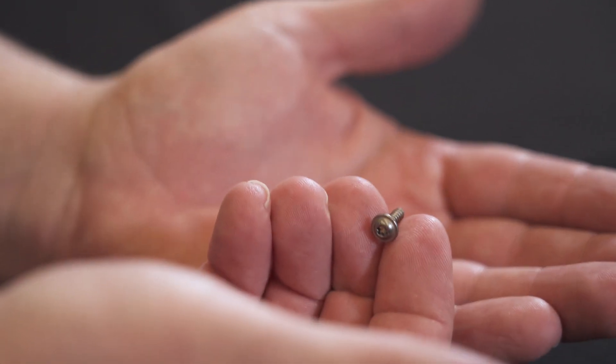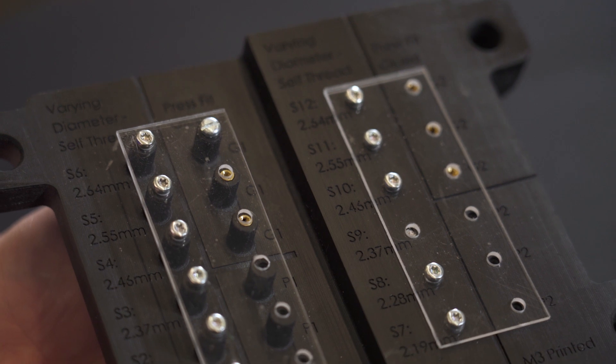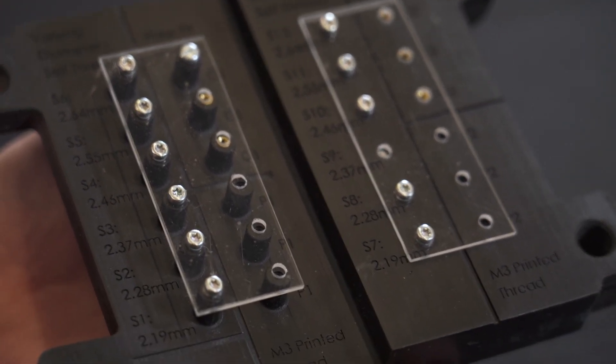So we said, why can't we use what we already know? We use a lot of screws in the three to four millimeter range — self-tapping screws. So we said, let's make some bosses with self-tapping screws, let's find out what works and what doesn't work. We did a detailed technique that we know from our injection molding background, where we drive the fastener using a torque-controlled tool. We graph the torque and angle curve, understand how it threads together, what the retention torque is, what the stripping torque is, and go through all of that detailed work.